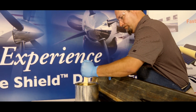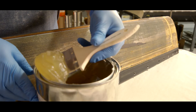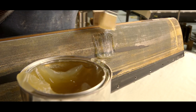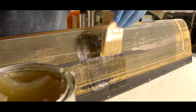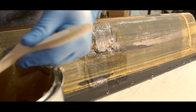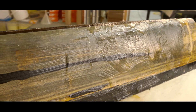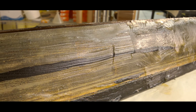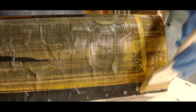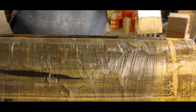After all pieces of boot are removed, apply a coat of a release agent such as Pierco 321 over the remaining adhesive and boot residue, and allow saturation for the time recommended by the manufacturer. Here at IceShield, we recommend Pierco 321 applied in a thick coat, allowing 15 minutes of saturation. If the Pierco adhesive remover turns white on the leading edge, apply an additional coat.